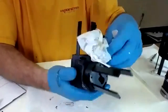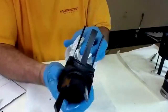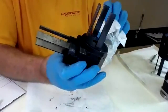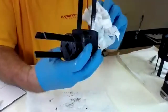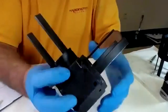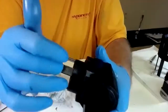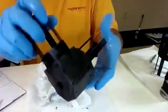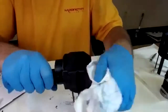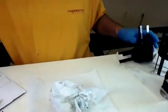So that's the first glue phase when it comes to the pivot. And again, apply some force. I think I was being a little weak, not pushing them in as hard as I could have. And again, as you're looking at this, you've got this strake touching this one, and this one touching this one. So that's creating this really nice right angle of carbon fiber on carbon fiber. Also going to get a new sheet of paper.